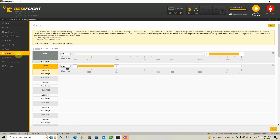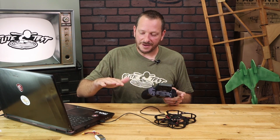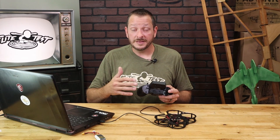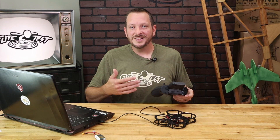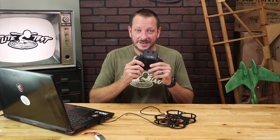Let's move on to our modes. If we did everything right, you're going to notice that when we flip our arm switch, it'll say arm disabled when the motors are supposed to run — when we flip it down. I always like to have everything defaulted to down, so when you plug this in it's automatically disarmed. For angle mode, the second one, I want it to be on as default, which means when you take this off it'll automatically be in a self-leveling condition. This is perfect for trainers and also when you come in to land in a smaller area — you can flip it into angle mode and you don't have to worry about constantly flying the quad. When I flip the two-position switch E off, it automatically turns angle mode off and goes into acro. We'll have additional videos showing how to change these different modes, but this is a really good way to get flying quickly.